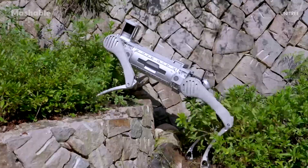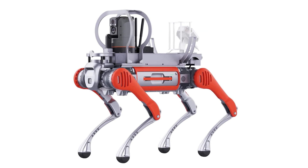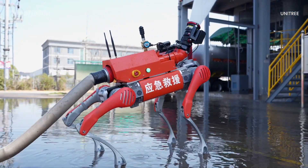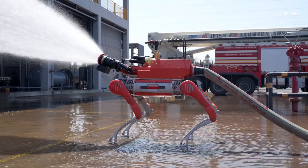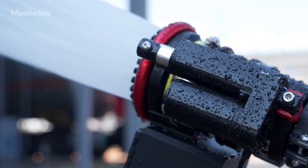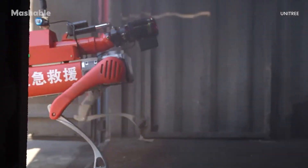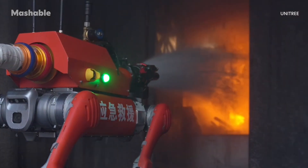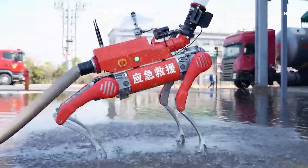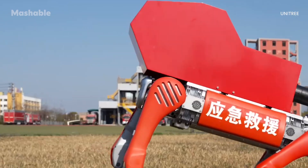The B2 has a modular design, which means it can be equipped with different tools depending on the situation. For example, it can be fitted with a high-powered water cannon. That cannon has a flow rate of 40 liters per second, a pitch range of 5 to 85 degrees, and a reach of up to 60 meters. It can spray both water and foam, and includes angle compensation to keep its aim steady while the robot moves. There's also a self-dewatering hose belt system that gets up and running in under a second, allowing the robot to start dousing flames almost immediately. To keep itself from overheating, the robot is equipped with a drencher system, which cools its exterior so it can keep operating near high heat without damage or shutdowns.